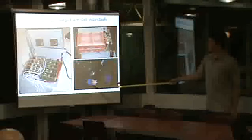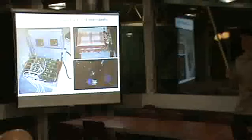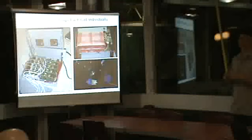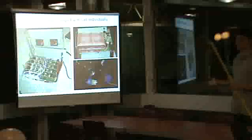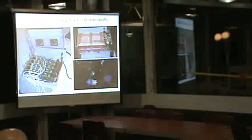And it also is problematic because you're relying now on an 11-pin connector between your charger and your battery pack to complete the circuit between each individual charger and each individual cell. But what if one of those pins doesn't make contact? Now you've charged up 9 of the cells, and the 10th cell doesn't get any charge. There is no contact made on the pin. You have no real way of knowing this, and then you go to drain the battery. There's no circuitry that will cut it off, and you've just killed that. So definitely not a consumer-ready solution for dealing with balancing lithium battery packs.